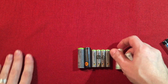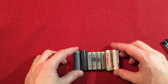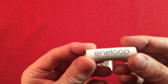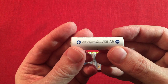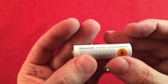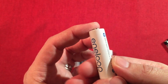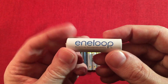All right, so let's just show the rechargeables I own. So I own about 4 different types, and by looks. And so we'll go ahead and go over each one. You'll recognize this one. This is the go-to rechargeable battery, probably of the world, the Eneloop. This is the white battery, made in Japan, Panasonic, a high-quality battery. Milliamp hour, it says 1900 minimum. They average 2000 milliamp hours, and the batteries can be recharged 2,000 times. That just seems incredible. Just imagine 2,000 times.